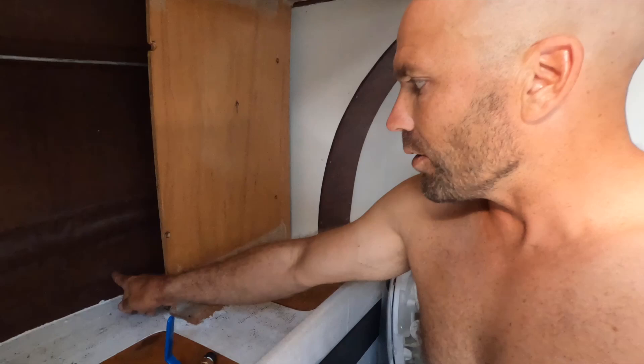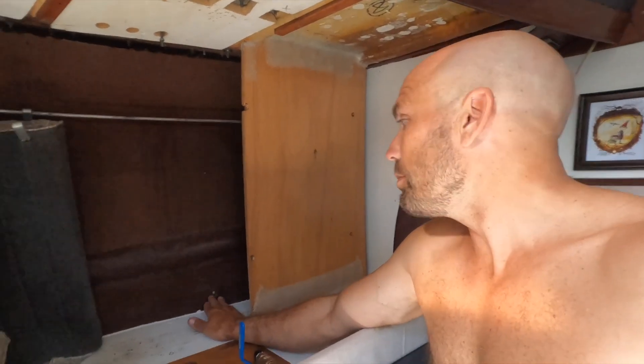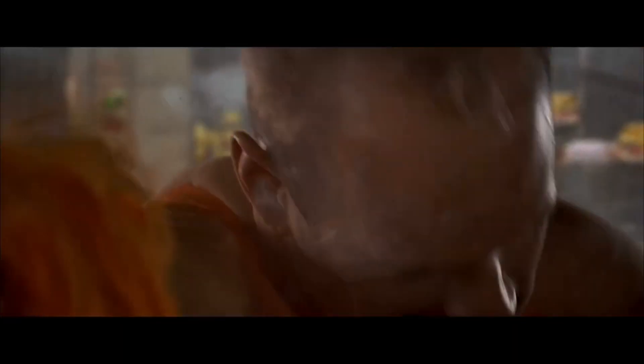Now I've got this brass skin fitting and also this ball valve, so it's just time to install this and put a little hole in the side of the boat as low as possible so it tends to want to just drain out, but not below the waterline because I don't want to put stuff below the waterline if I don't have to. My boat is solid fiberglass - if you guessed eight and a half mil for the hull thickness, you'd be right. Here's a hot tip I just found out: acetone is heavier than air, so if it's not stored properly, just like LPG or gas, it can sink into the bottom of your bilge and you can get some pretty spectacular fireworks. Now I know and you know.